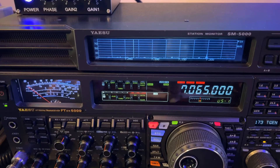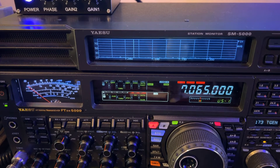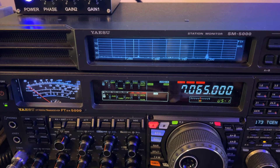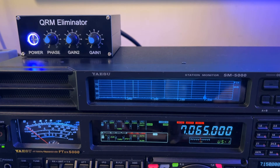If I were to connect an RCA cable to that receptacle on the back of the radio and then plug it into the QRM eliminator, that will take care of it. But I will mention that there's a relay in the radio that's going to click every time I do that - that's what it's made for, but it will eventually wear out. Having the foot switch anyway and not needing the RCA plug, I'm just eliminating use of the relay inside the radio. Honestly, if I were going to do a lot of CW with the QRM eliminator I would probably go ahead and use the TX ground and hook up an RCA cable.